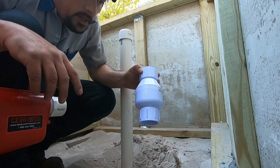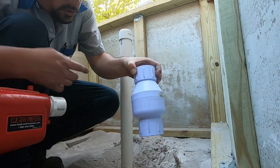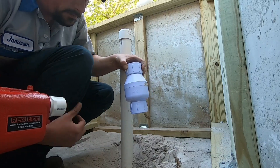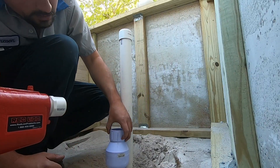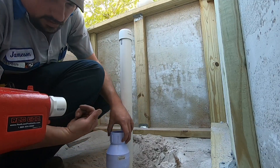This is my check valve — you see it's got an arrow on it right there. Make sure that it's going up, away from the well and towards the pump. Now I'm gonna chop this thing off down low so I have enough room to make this bend to come into the pump.